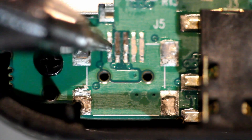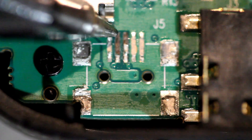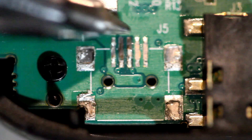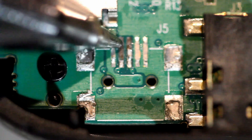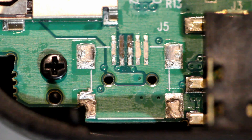I don't really have a good way to record what I'm going to do in the next step. Basically, what I'm going to do is take a thin piece of wire, solder one end of it here, and kind of make a tail out here — solder it to here and kind of bring it outside of the board. Then when I solder the connector down, I can cut it off. I use a magnification — it's kind of like a jeweler's loupe, like a really super nerdy looking pair of glasses, but it has like 5, 10, 15, 20 times magnification, so you can see what you're doing in occasions like this.